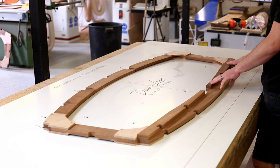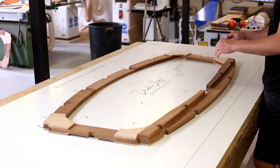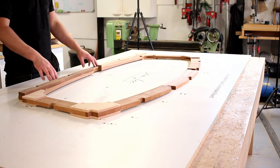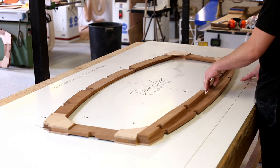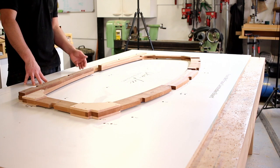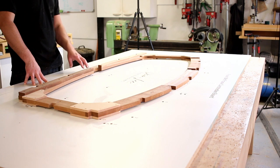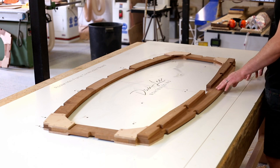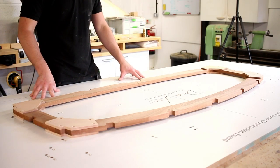You've got these little sections on the aft side of the frame which support the floor from this frame back. The main floor frame is slightly deeper, which carries the forward part of the hull. What happens at the keel with this frame is that the aft keel comes through the top side of the frame just here, and the forward keel fits to the face of this frame. You've got a keel filler block which spaces the aft and forward keels at the correct angle, and that fits onto the front side of this frame.